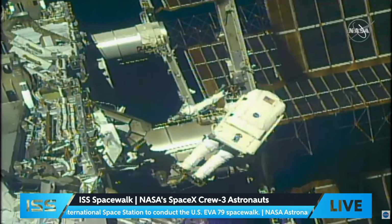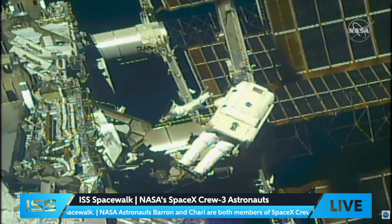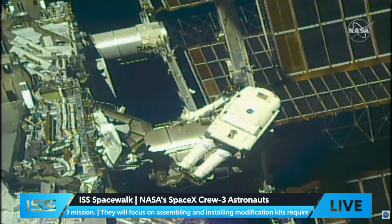Okay, Kayla, if you could check the gap between the strut boss and the bearing surface and also give it a wiggle test. Looks parallel with no gap and good wiggle test, so secure to me. Okay, we call that a good M21. And you can socket swap the 2-inch from the torque wrench back to your short PGT.